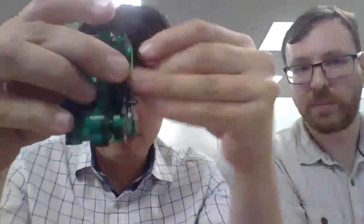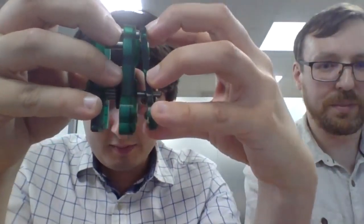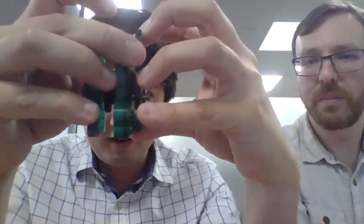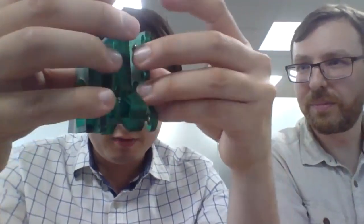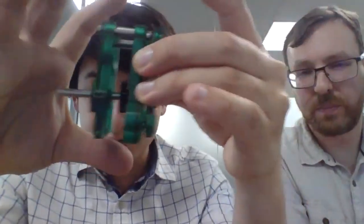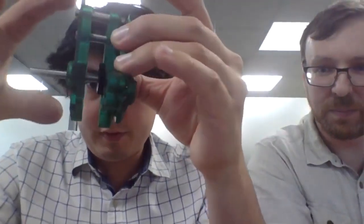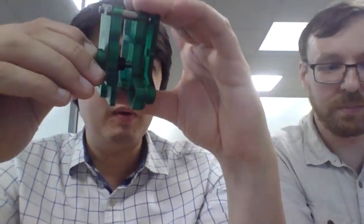Who's taken using the nozzle for bed leveling over a switch? For the longest time, I've really wanted to do probing through the kinematic coupling. When your tool comes along and you apply a force to it, it causes a slight displacement on the kinematic coupling, and you don't even need it to disconnect. You can detect that touch by applying a small current through the balls and the pins, so the ball landing on the two pins completes a circuit. Definitely want to do that, but not yet. I think using the nozzle in that way would work extremely well.